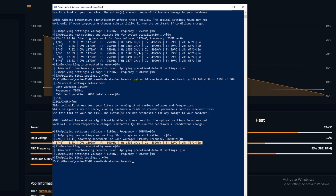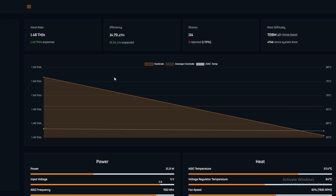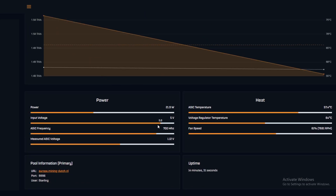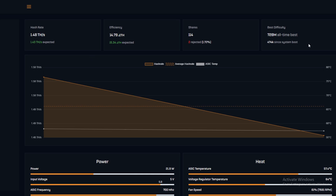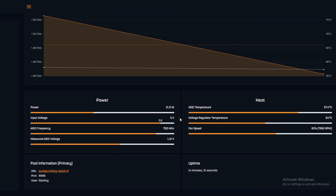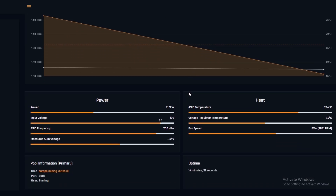We'll try to figure out a mounting solution. The power wasn't too much - only around 21 watts. The fan speed was working, just powering both fans at 7000 RPM, and that leads me to believe the input voltage wasn't handling it well. For a new power supply, I'm thinking of going with a MeanWell at around 200 watts, to have some headroom to add other things later - maybe a NerdAxe. Let me know in the comments, make sure you like and subscribe for more content.